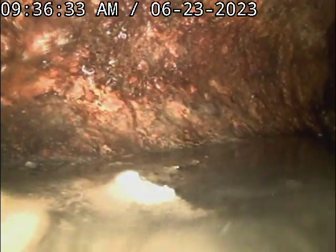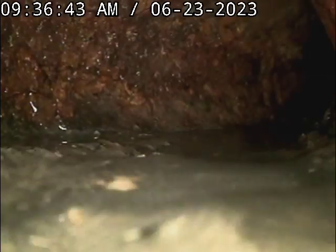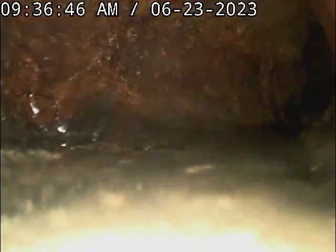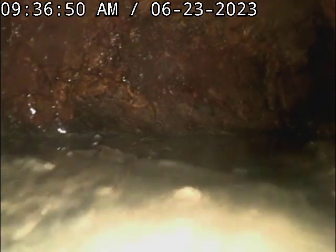See how the water's all above the camera. And then we go here and we can see pipe. The pipe from here — the pitch on this line seems to be screwed up. That's a Y right there. Something's coming from behind that as well. There may be another bathroom, or this could be a floor drain — I'm not sure.